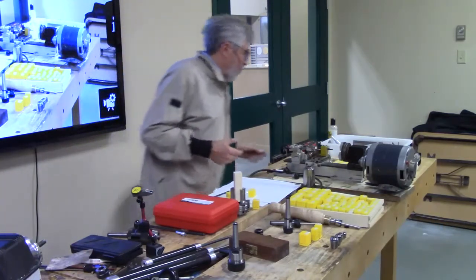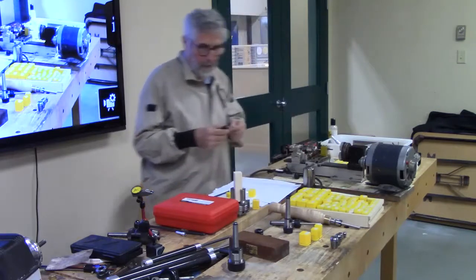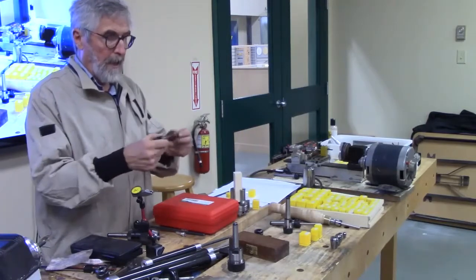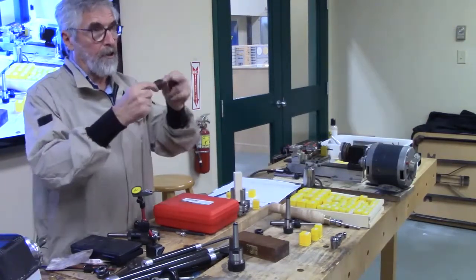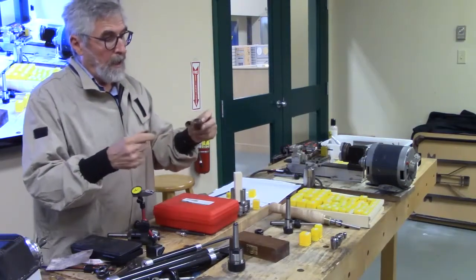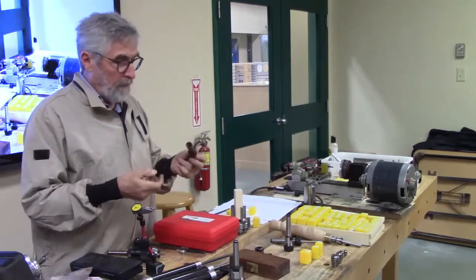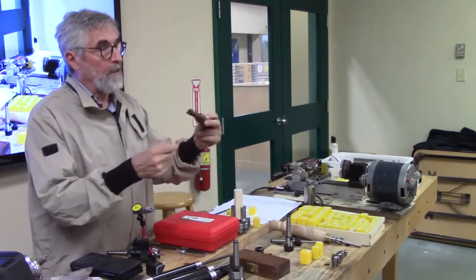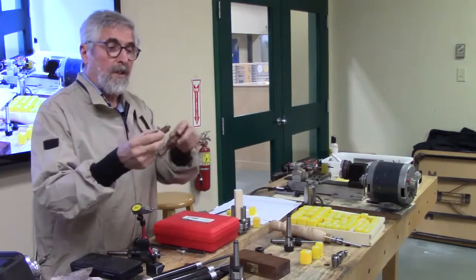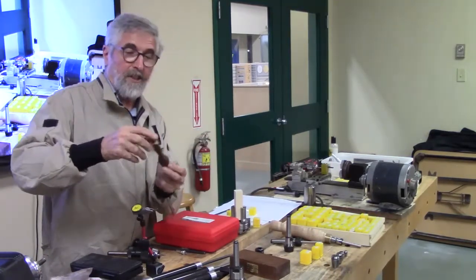Finials. So the beauty about finials, so this is another little project that I was working on. I haven't quite finished it, but started off, put this between centers, turned a little tenon on it, not a very big tenon, that's more than I need for collets. Able to then bore it out inside. Do all my shaping, basically free. Then I've got a matching piece here that I put another small tenon on that I could work with. That guy goes, it's a pretty good fit inside there. That's gonna eventually get glued in there.